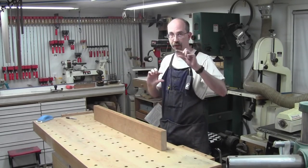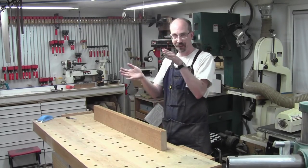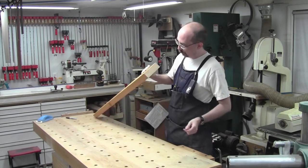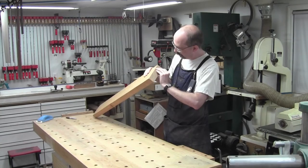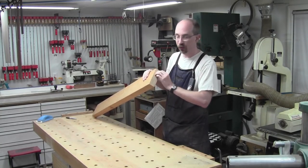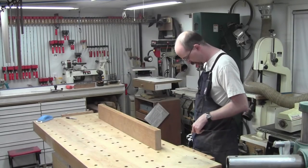This piece of spruce is the same — there was a chunk here that went into the 335, the little shims between the front and back skins and the maple slab in the center. This is some really good spruce. It's very tight grain. I would say there's 40 or 50 grain growth rings per inch, and it's fully quarter sawn. It's very good stuff.